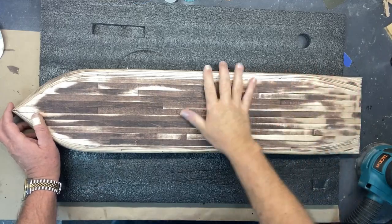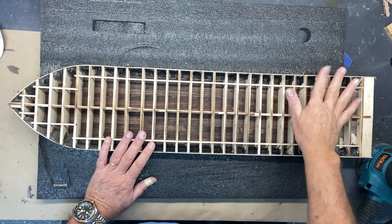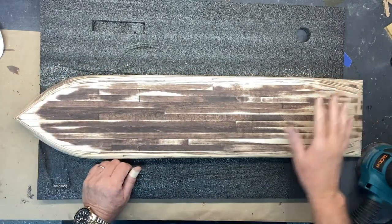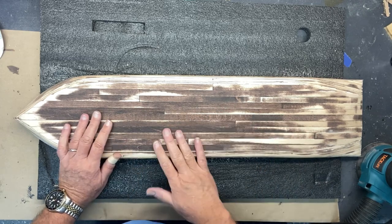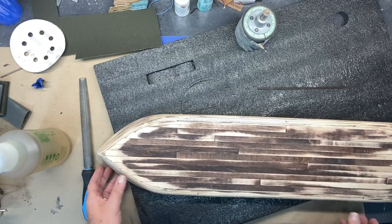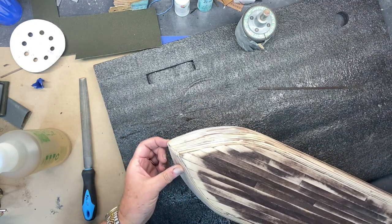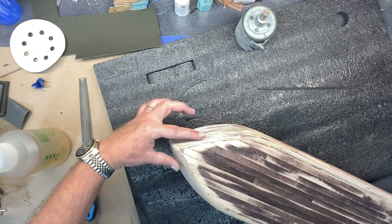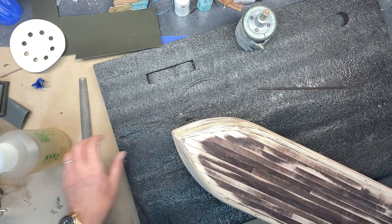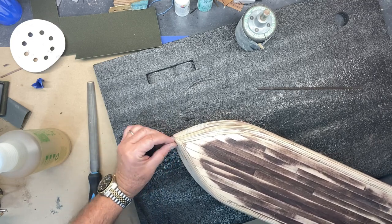That's the finish of my initial rough sanding. I've got everything routed off to my satisfaction — I made sure the outer edges are even with the tops of the bulkheads. Now I'm going to finish sand by hand with fine sandpaper. Once you get all the planks sanded how you want, the instructions say you need to put the keel part on, going all the way to the very bow of the ship. I had run the side planks into a point there, and now I've used a combination of sander and file to get back to that original center keel.